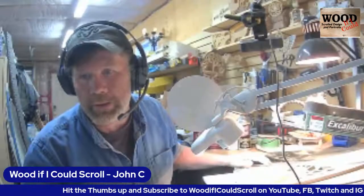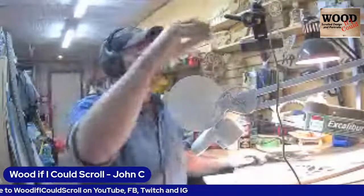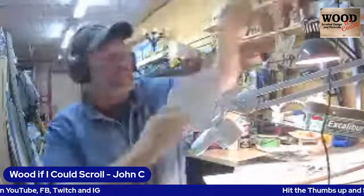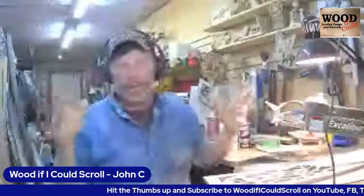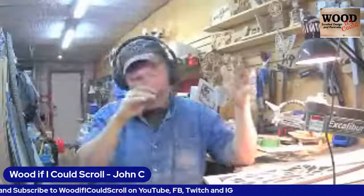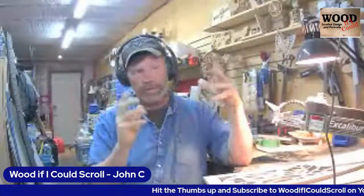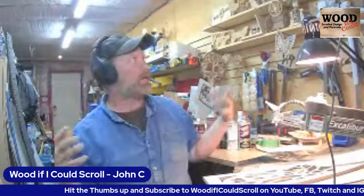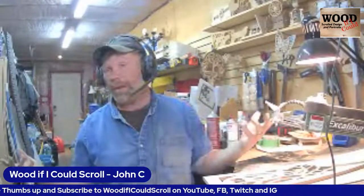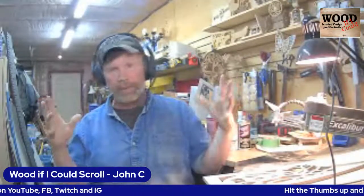Do you use smaller blades than Charles does most of the time? Not trying to be picky, just learning here. Yes, I always use smaller blades than Charles does. Most of my work is more detailed than Charles's, but on a smaller scale. So like Charles's cuttings, for example, let's say 24 by 36, I'll take the same pattern and put it down to 8.5 by 11. So I get the same amount of detail, only in a smaller scale. So I use a lot of smaller blades. Most of my cuttings are not larger than 24 by 12 for most of my signs and stuff. So all my patterns are scaled right down to make them smaller.